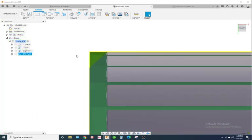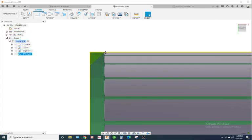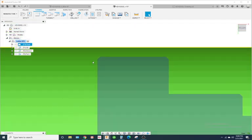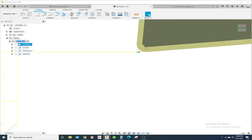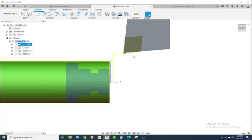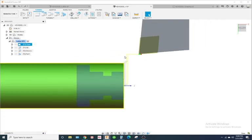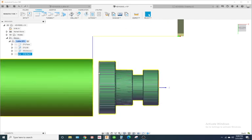And also, as a side note, you don't have to chamfer it with the part off. You could actually use the turning tool. But with that said, because this is a 45-degree chamfer, you wouldn't be able to use the 80-degree insert we're using. Like this is an 80-degree insert, right? There's not enough clearance for that cutting tip to get down there and cut that chamfer. You would have to use a tool that's less than 45 degrees, so a 35-degree tool. But that's for a whole other video. Okay, so back to the part off.